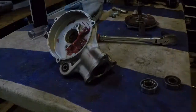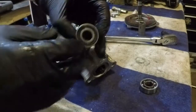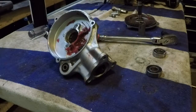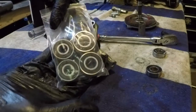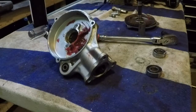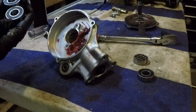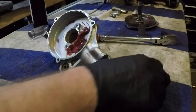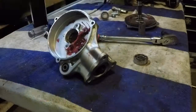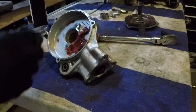There's the inner bearing. Now as you can see the outer bearing has got a rubber seal on it, just on one side, whereas the inner bearing was open. The replacement bearings that I bought are completely sealed on both sides all the way through the drivetrain. That just means you won't be able to put additional grease in there, but they should be greased for life when you receive them. The outer and the inner are both 6202 sized bearings. The OEM one is a 6202 RS on the outside seal — the RS designates the rubber seal. Both new bearings are rubber sealed, so these are both 6202 RSs, and it doesn't matter which of these goes where.